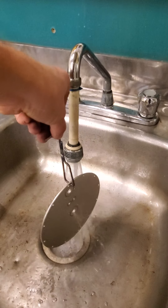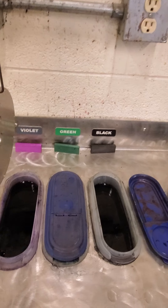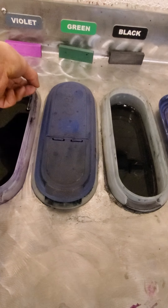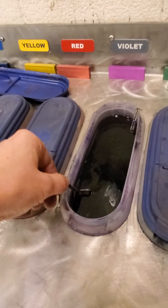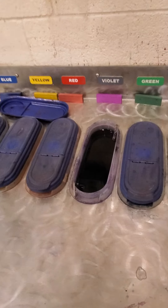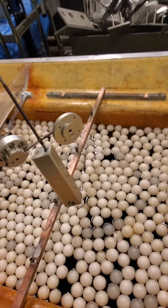Of course if you don't want to dye your parts and you want the bright aluminum finish, you would just seal them in the steam right away. I have to be careful — if I put these two parts in together and they stick to one another, you can see how nicely it's already accepting the dye. If they stick, I'll get an imprint where the dye didn't contact the part, so I'm putting them on opposite sides of the container.